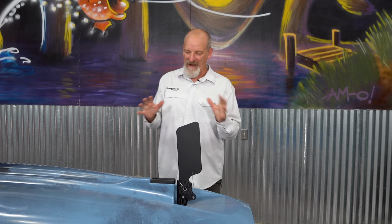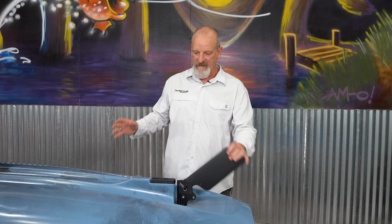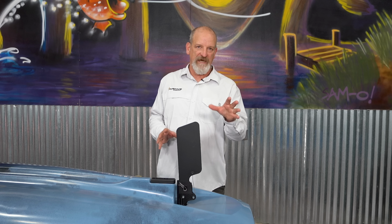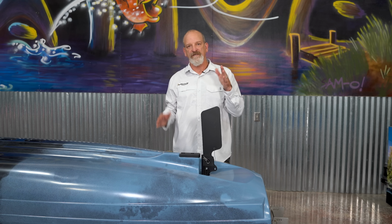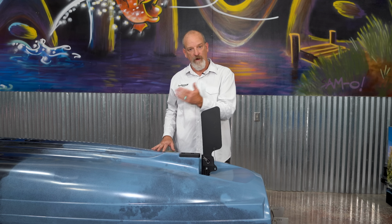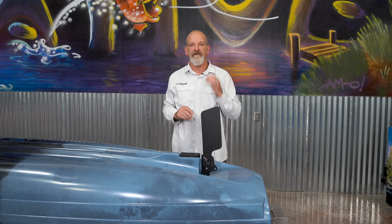And back here at the back of the boat, it looks like boats we've done before. You've got your classic keel coming into the spring blade and the pontoons tucking in a little bit, but this is where we changed things up, and we wrapped this hull around the back end of the boat right at what most people's water line is going to be, so that the water comes back together more cleanly, so it's more efficient through the water. It's also rolled so that this boat will slide around turns very efficiently.